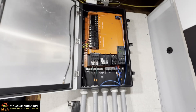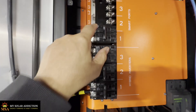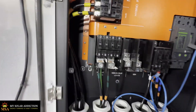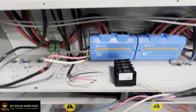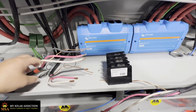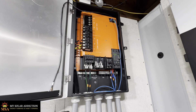When we actually add in the grid boss, the plan is to use this wire here to run a connection to smart port 1 right here, which is the recommended port for AC coupling. So there will be a cable running from here — 8-3 — coming down through here and then up into this area here. And when we disconnect these and run the 18k PVs to the grid boss, I'll disconnect these, and then we'll have the AC coupled array continue on through this block all the way up to smart port 1, where we have it AC coupled on the grid boss.